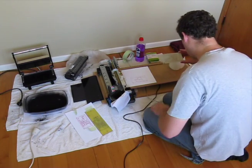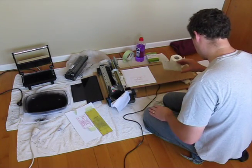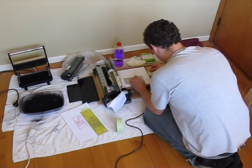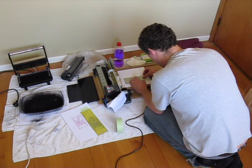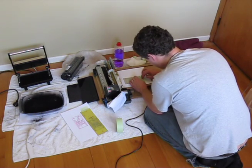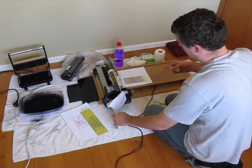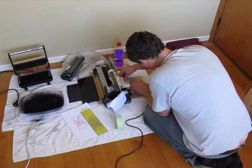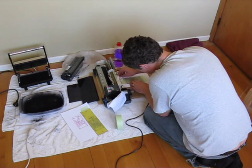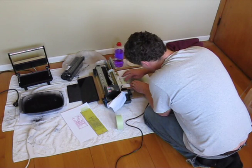Let's make sure we get it all aligned properly. If you print it and it doesn't line up, you just have to wipe the whole board off again with meths and start over. Once you do get it to line up, then again we bake it on with the toasty maker. You'd be surprised — once it's baked on it's actually really quite strong and it doesn't really scratch, so it gives us a nice professional finish.